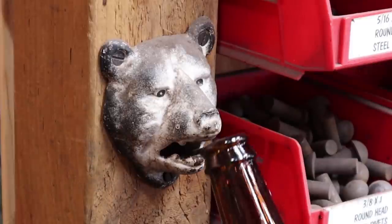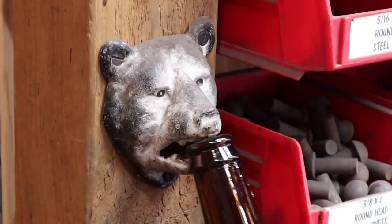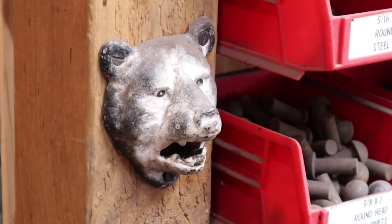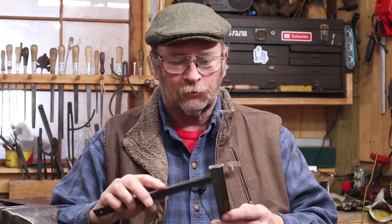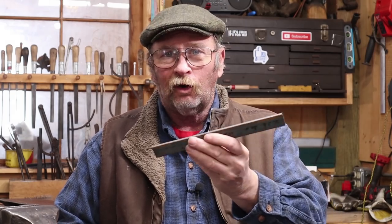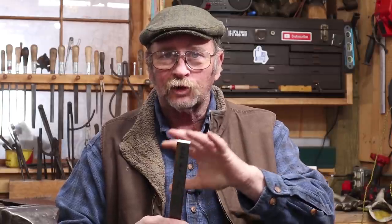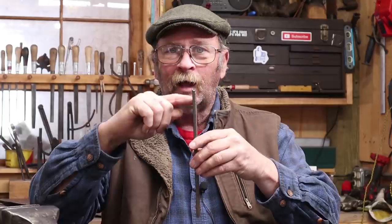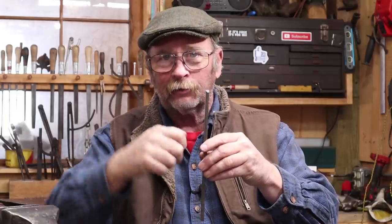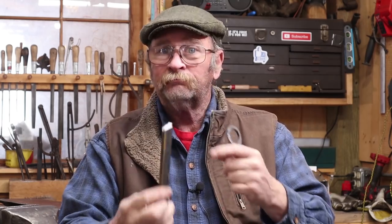I got this cool cast iron bear head mount on the wall. He's supposed to be a bottle opener, but his teeth have been so worn out over the years that it doesn't work anymore. So let's make a nice hand-forged one. The bear will stay because I think it's a cool iron casting. I'll start with a piece of quarter inch by one inch flat bar — about six millimeters by 25 millimeters. This is going to be a fairly simple wall-mounted bottle opener with a flat place on the top and bottom to mount to the wall, coming out at an angle, and down on the bottom side is where the bottle opener part will be — essentially a ring-style bottle opener in the middle of the bar.